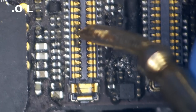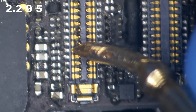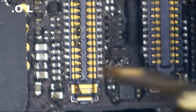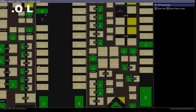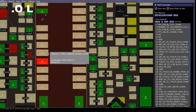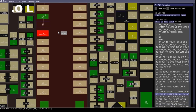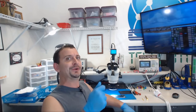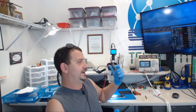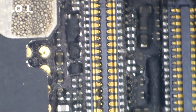We've got something that's not getting a reading. Let's count it out: one, two, three, four, five, six, seven, eight — that is the eighth pin in that row. Looking at the board view, we count one through eight: that's MAMBA MSYNC — we're not worried about that one. So it's not looking like we have an image-related problem right away.